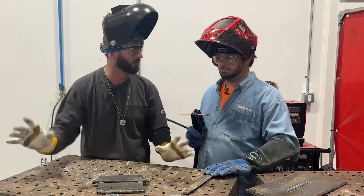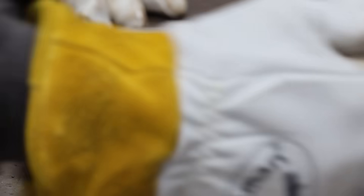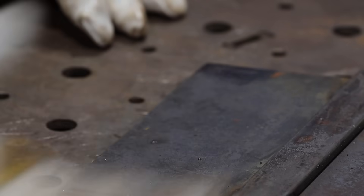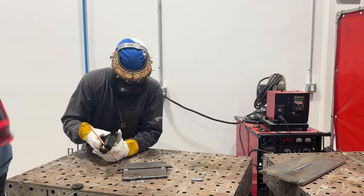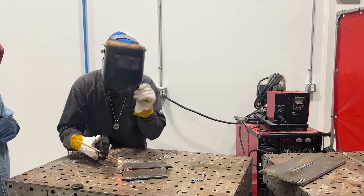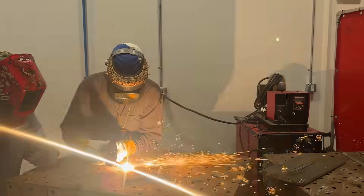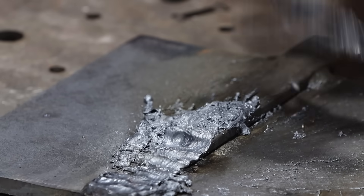When I was in welding school, we would remove backing straps — this is going to really teach you how not to damage the parent metal. If you did, my instructor wouldn't let me bend my test anymore, so there was a lot of incentive. We're going to remove this entire backing strap — these little welds, everything. It's welded all the way down. We're going to see fusion in the center of this joint as we sweep it away, then see no fusion as we rip this backing strap and turn it all to pudding. Just little sweeping motions.